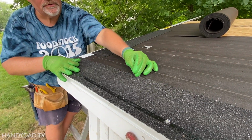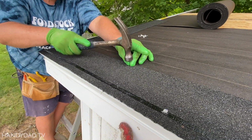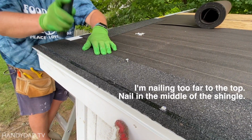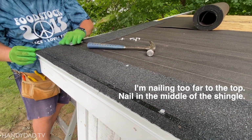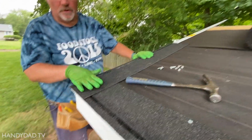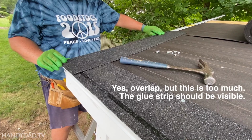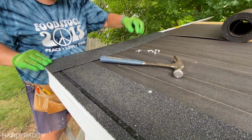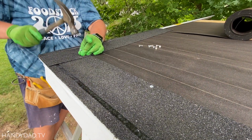And right now I'm just using 1-inch nails. I also have 1.5 inches for later when I'm putting the shingles on. And then this one is gonna come down here. Notice it's overlapping. Even with the edge, actually a little bit overlapping the edge, just nice and smooth. And then I'm gonna put a nail here through both of these.